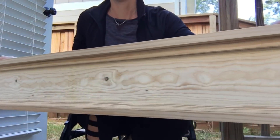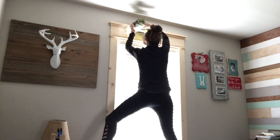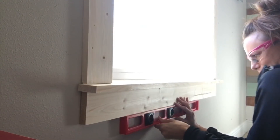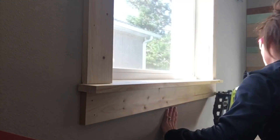So your 1x3 will be cut 1 inch longer than your 1x2s to create a 1-inch overhang on both sides as well. This is ready to go up on the wall, and I'm using 2-inch nails to fasten it. I noticed curtain rod holes here, but I'm going to cover those with spackle. The new apron lines up flush with the two vertical frames, creating a 1-inch overhang with the stool above it. Using 2-inch nails, we're fastening the apron and the stool.